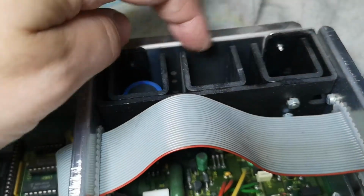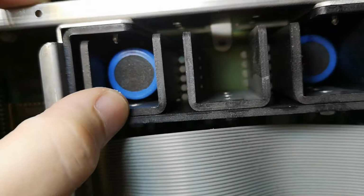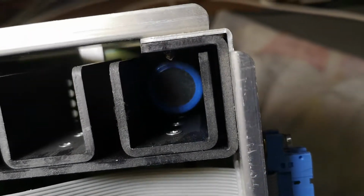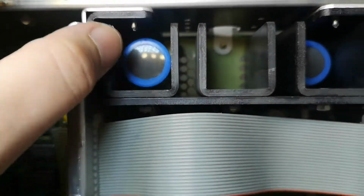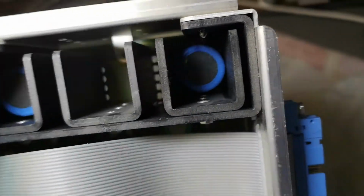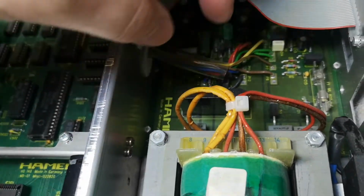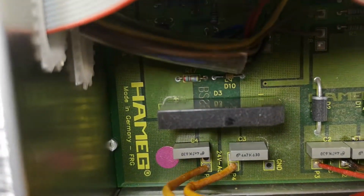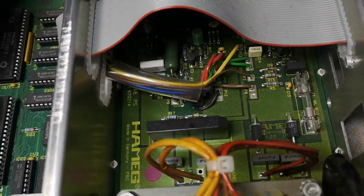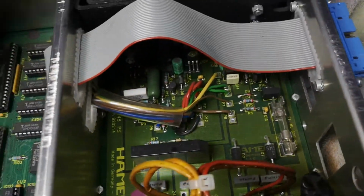And what have you got here? The hottest spot, and here is where you put the capacitors. No. This is not good at all. Those capacitors are slow, and they should have been placed far away from anything that gets hot. And don't even put them right next to the rectifier. They can actually be a little bit away from the rectifiers.